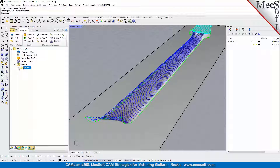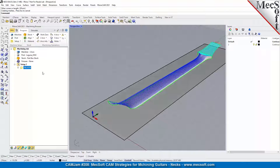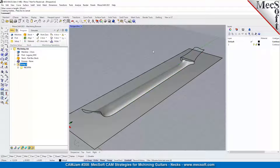You're still going to get the same result because you're containing it to the centerline - you need to create offset curves as well. Here's another interesting aspect of control boundaries. Not only do you want the tool to get down to the plane, but you also need to control how far out it goes when it hits the plane. We showed this with the guitar body where we had the outer perimeter and then offset it by the tool radius.